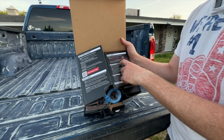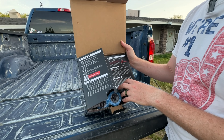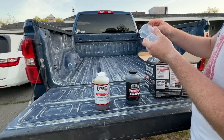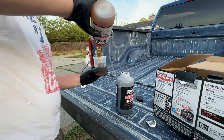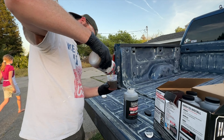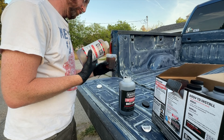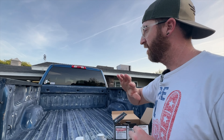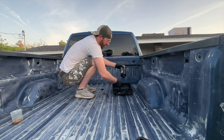This pro kit comes with instructions on the package. It's a two-part system — different instructions depending on whether you apply it via roller or spray. You're going to measure out six and a half fluid ounces of the hardener, pour it into the can, shake it for a minute, and that becomes the mixture. First though, get a brush, go around all the edges and tight areas to cut in, and then use the roller to do the rest.